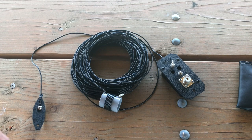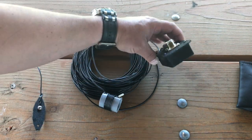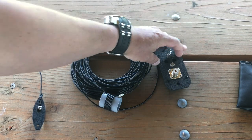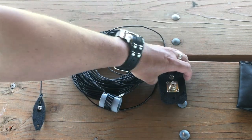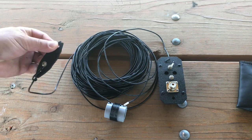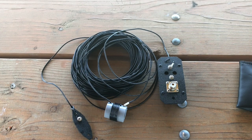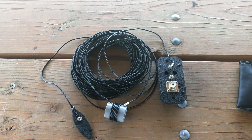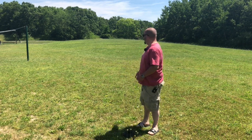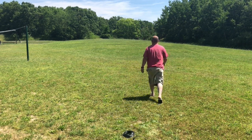So just a quick look here at the components of the antenna. Basically, this is your matchbox that's got some kind of un-un in there. I haven't taken it apart to see what all the bits are, but pretty simple, very lightweight. You've got a choke here, and then you can throw this in a tree and use it as your connector if you want to run it as a slope or a long wire. I'm going to run it as an inverted V. In Michigan, we can't throw antennas in trees, so we'll see what happens. Here's the start of it — all 132 feet of it.